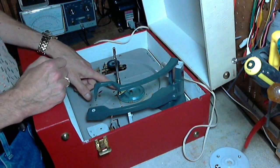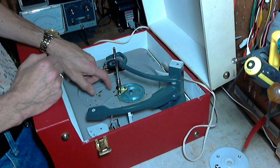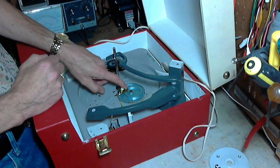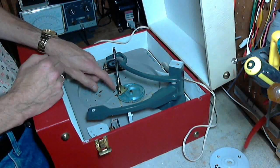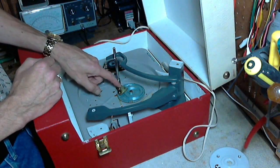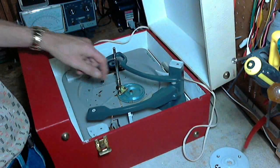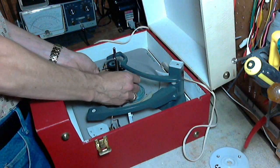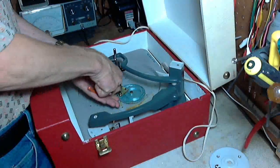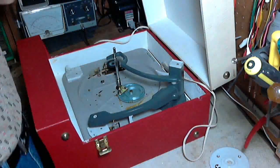Just before I lift the race off, this piece here is really critical — it must be as loose and freely moving as possible. It should not be greased up. You can put some very light oil on it if you want, but it shouldn't even need that. I've had some of these fuse solid to the pivot shaft, really hard to get off. This one isn't quite loose enough in my view — I'll try to make it a little better. Let's pull that one off. I'm working without my favorite tools — terrible.